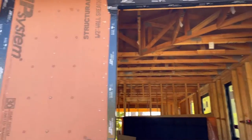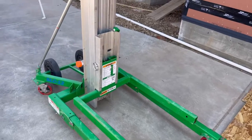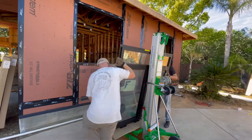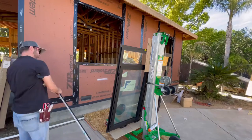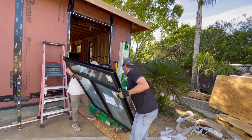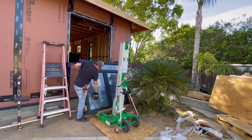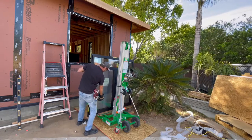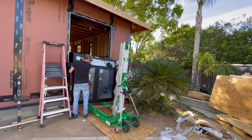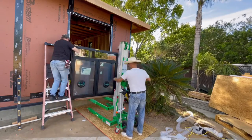These large windows are very heavy. I rented this beam lift — our plan is to put the window on that, raise it up, and then set it in. This is a different window being shown as we use the beam lift to get it in place. Along with the beam lift, you can rent these extenders that go on the two forks — that's very helpful as we push the window to the very front of those forks. Then we asked another one of our guys, Rod, to help crank the unit up in place and get it close.